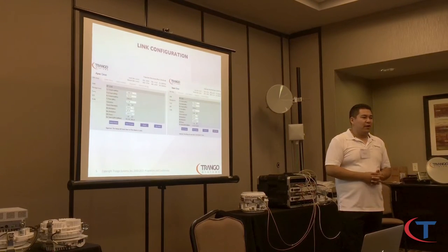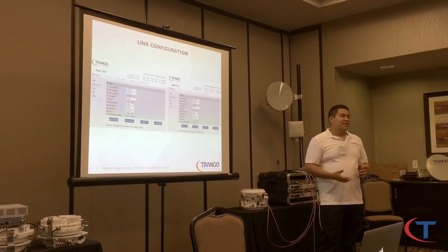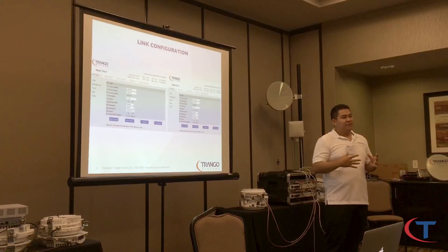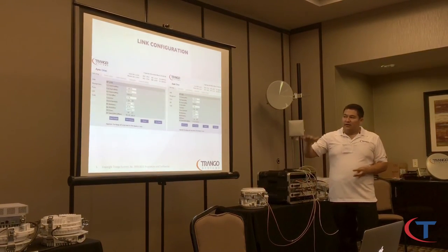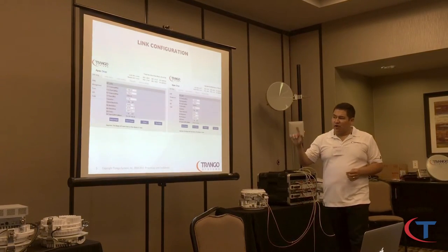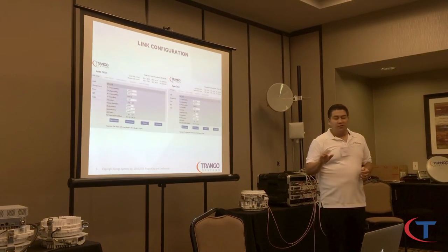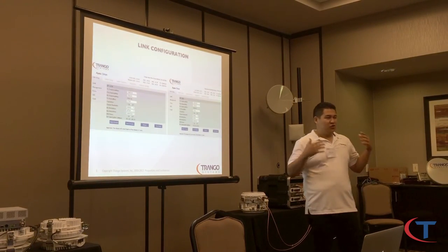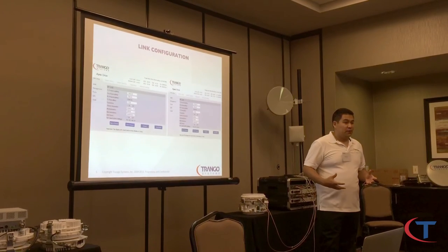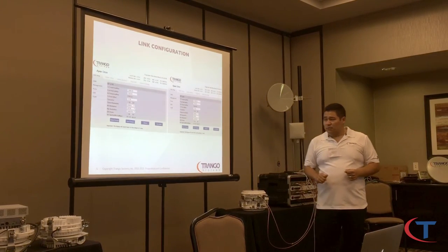XPIC and PLA have a lot of binary differences between platforms. On past products, people tried Apex Plus with Apex — keep the same platform for ease of use, and to avoid software bugs between mismatched versions. Also check transmitter on/off status and channel bandwidth. Channel bandwidth is key and easy to overlook — if it's mismatched at 160 vs 120 MHz, you might have a good RSSI that's screaming, but the link would not lock. Also verify min and max modulation settings match.